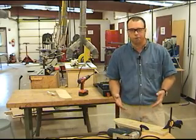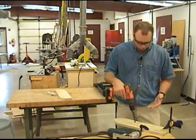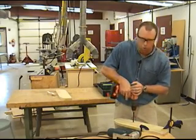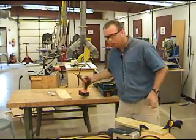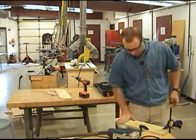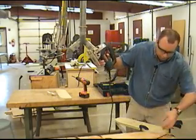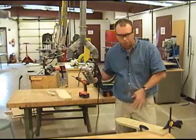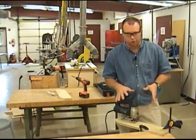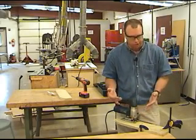So how do we cut out an interior area without forcing the blade in? That's where a drill comes into play. You could drill one hole in the middle and do a bunch of freehand cutting to reach the corners, but my recommendation is to drill a hole right in each corner. Remember from drill operation: if the bottom of the workpiece matters, clamp a scrap piece underneath it. Apply the same safety procedures — keep the base on the wood at all times and don't remove the saw from the workpiece until the blade has stopped. The holes in each corner will allow you to keep going right around each corner. Plan ahead for any clamps in the way, as you may need to complete the cut in a couple of passes.